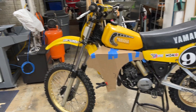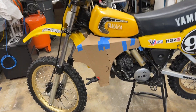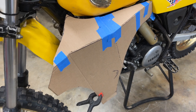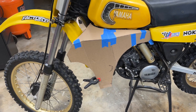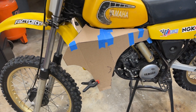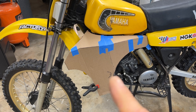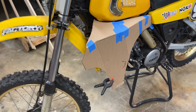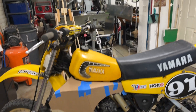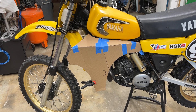Let's make that happen. Now the challenge is making this in aluminum. I do want to put a bend right there and another one there. I don't have the means to do that without really marring up the aluminum, so I might just cut and weld that. So there is going to be a weld seam on top there, probably a seam there. This might be a trip to Harbor Freight to get a bender, but I don't know if it'll bend — that's an eighth inch aluminum. I don't know if the cheap Harbor Freight benders will bend that. Alright, let's get to cutting.